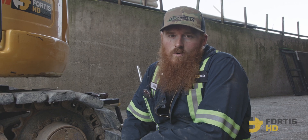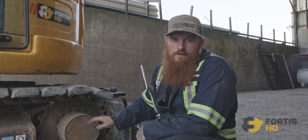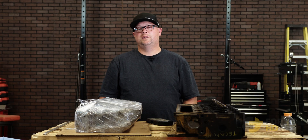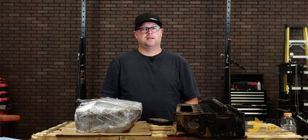Hey, I'm Mike and I'm going to show you how to change the oil in your final drive on a John Deere 85G. You can buy gear oil for your final drive or even a complete final drive at FortisHD.com. To service your final drive, you'll need 1.2 liters of 85W140 per side. If you're doing this service yourself, make it easy and purchase one of our service kits that will have every filter you need.